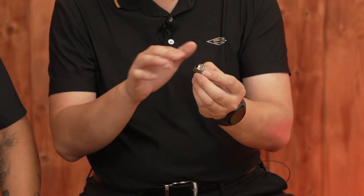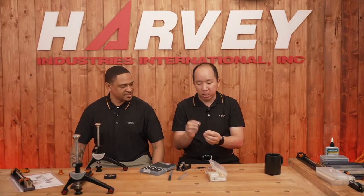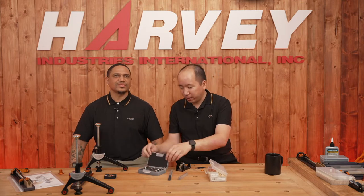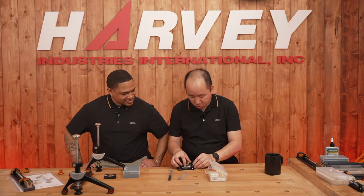So you're realistically just going through and polishing, smoothing it out, and getting a nice sharp edge. Makes sense. Don't do it too much because then you'll remove too much material and wear out the die prematurely. So I hope that answers that question. Let me put this back in there real quick.